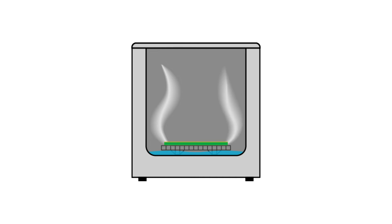A vapor phase reflow oven works as follows: pour your PFPE fluid into the container, place the PCB on a rack above the fluid, and close the oven with a lid so the vapor cannot escape. Then heat the fluid until it reaches its boiling temperature. The PCB is then enclosed in vapor at boiling point temperature and the heat transfers to the PCB and the soldering joints. Subsequently, the heating stops, the vapor condenses, and the oven starts cooling the container until all vapor has condensed and it is safe to open.